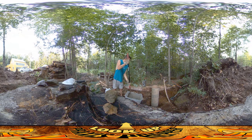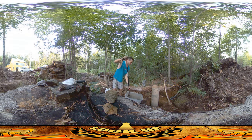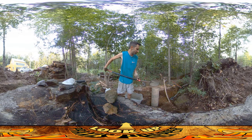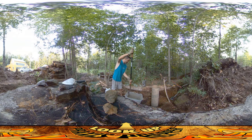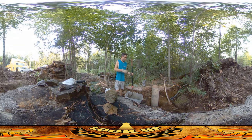For now I'm just shoveling more concrete in, and it's exciting to be getting this part of the process going. Today is September 12th, and while we still have plenty of nice days to work outside, concrete work can't happen if it gets cold at night — the concrete cures better if it's not allowed to get too cold. So I really want to get all these concrete footings done before it gets too cold. After the concrete's done, it can get as cold as it wants and I can do my carpentry work. Whatever reason I come up with to light a fire under myself to get going, I just run with it. Thanks for watching.